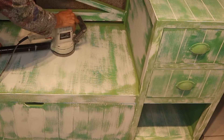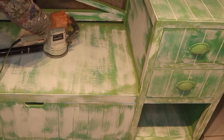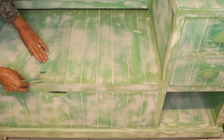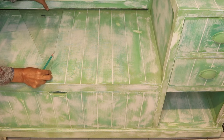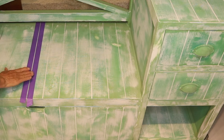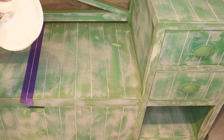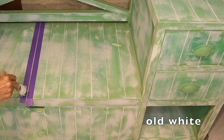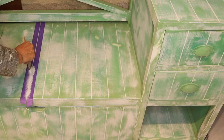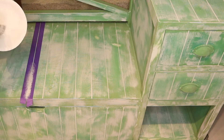When it is completely dry, I am sanding the whole surface with fine sandpaper. I want the bench to look like it is made of pieces of wood, so I am dividing it into pieces. Then applying masking tape and a good amount of old white paint. The paint should be very thick, almost dry — if it is runny it can go underneath the tape.